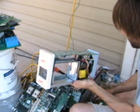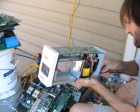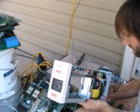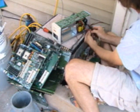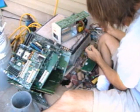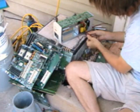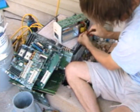This is the soldering and wire terminal process. I'm going to send two wires in through the hole that the AC cord went out through, then tie them onto the wires that were previously connected to the battery inside the UPS unit. I want to solder the connection to make sure it's a good connection, then put a wire twisty and tape it up with electrical tape to make sure there's no chance of it shorting out.